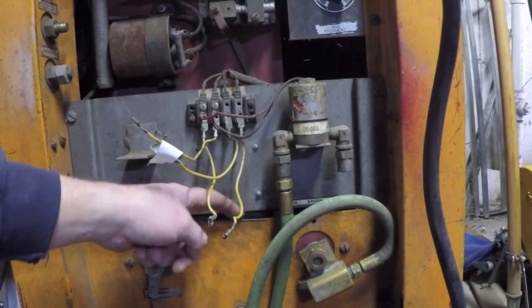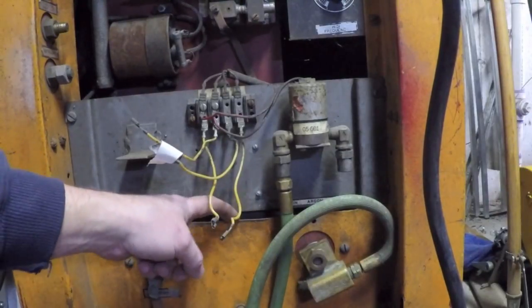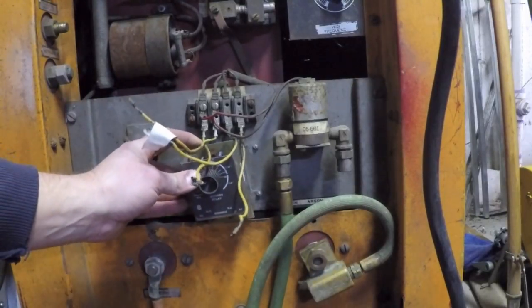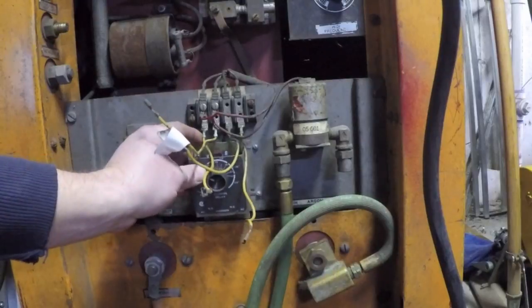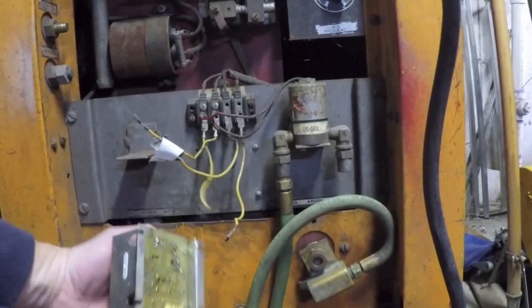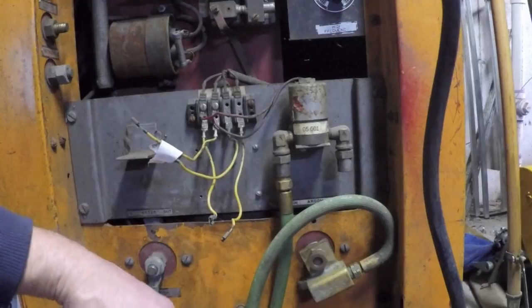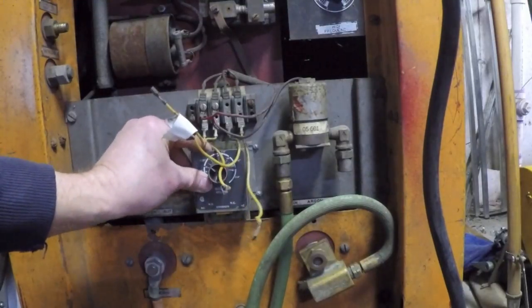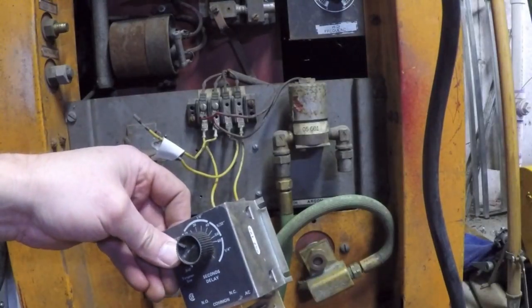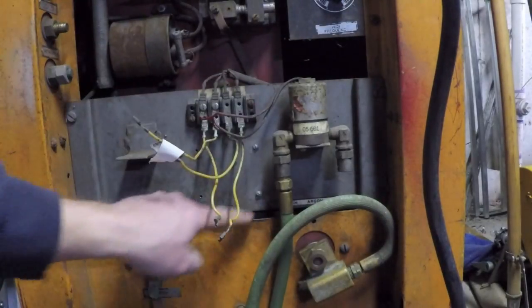First, this is all bent up because I took some pliers and I rudely bent this out so that I could get this PC board to sit behind this. And I thought, okay, that'll solve my problem, because this way the foil runs on the back of the PC board right here. These contact points won't be able to short out against this. The problem is, I realized as soon as I did it, I still had a problem, because when I put the spade connectors onto these connections, they're going to short out against the case here.